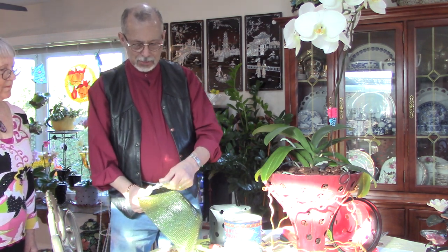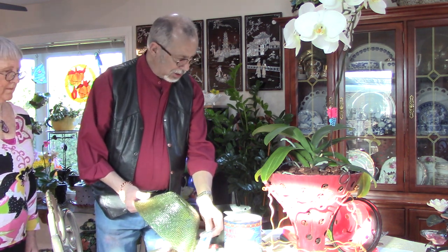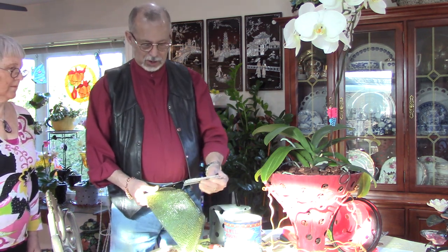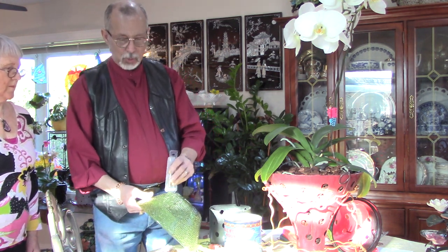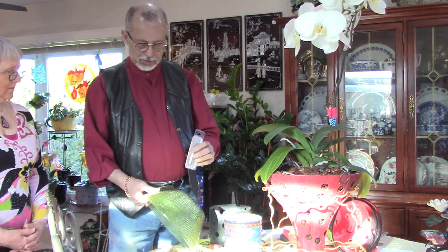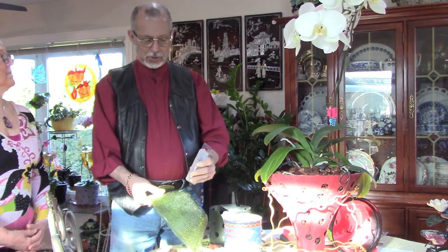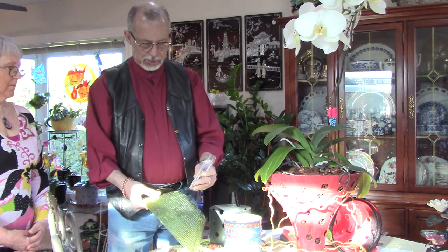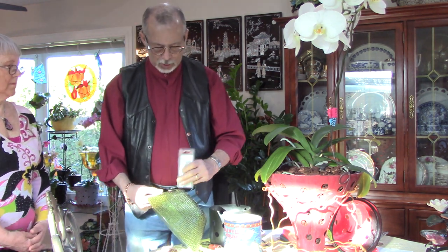And then I take my diamond bit. I prefer the diamond bits. And you can get packages of every size you can think of, and they're not that expensive anymore. They used to be. And if you keep that underwater and you always have water running on it and you drill, the thing is to take your time. Don't try to rush it. Don't push it. You start shoving on it and pushing on it, and next thing you know, something moves, and now your bit has broken the dish. So make sure it's supported strongly, and you take your time, and always keep water on it.